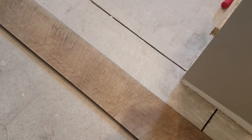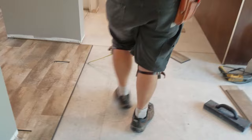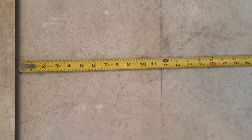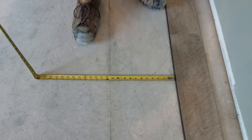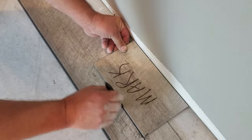I still have my main chalk line snapped here and I'll see where I need to be — I'm at 11 and 5/8. I go down and straighten this floor out so that it's 11 and 5/8 the whole way. Once you make your cheater board, you just put it up against the wall — you can go under the sheetrock or right up against it, depending on how you want to finish.